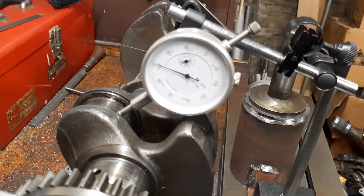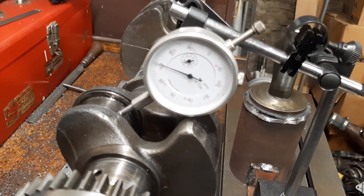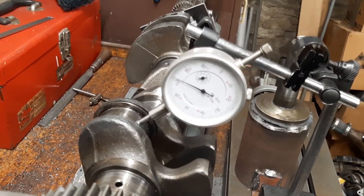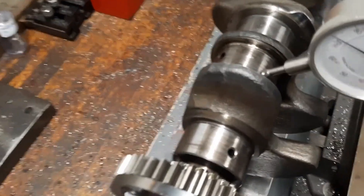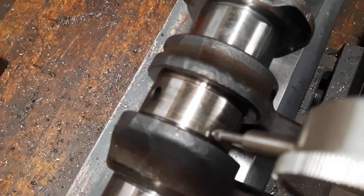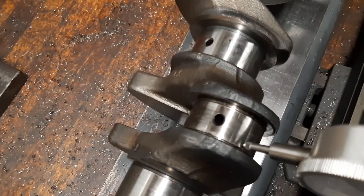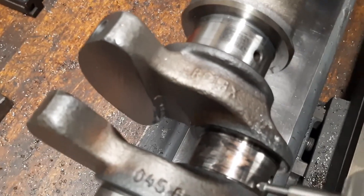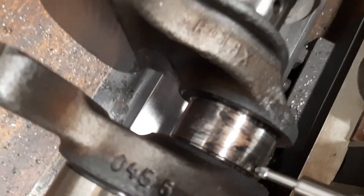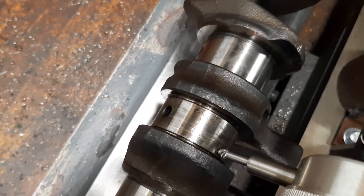I can't go the whole way around because I'm going to grind this — this is the bad one. We will be removing material from a half-millimeter undersized bearing. It's ten thousandths on a side, so twenty thousandths under, which is a half millimeter. You can see that bearing journal is pretty smoked — it could be a lot worse, but there you have it.